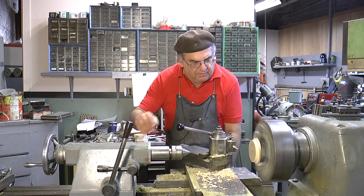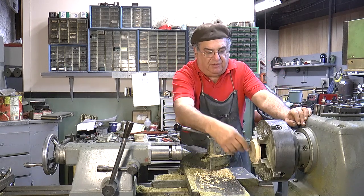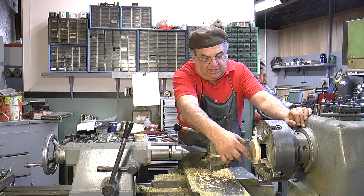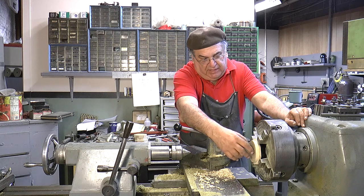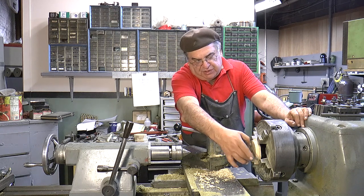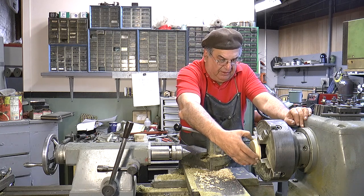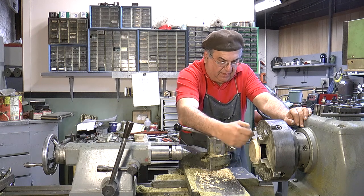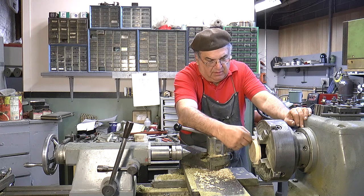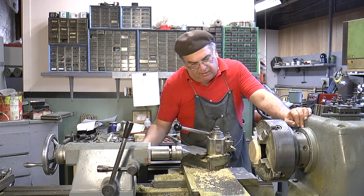I'm going to end the turning right there because this particular one has a step in it. This is the one that has the two little ears on it to hold the crosshead guides. The plan calls for it to have a quarter-inch step back down to about two inches, which I'll do on the pattern here and then taper that. Later on, we're going to hold it out here and I'm going to turn the other side, face it down, get it a little thinner. I could have made this out of aluminum, but wood's all right — it's just as easy.